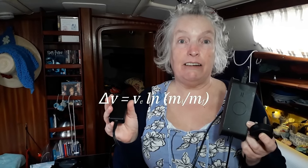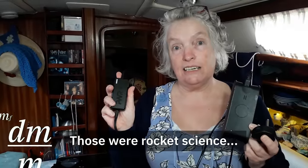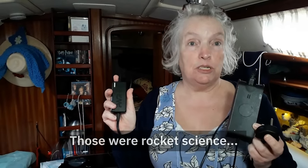When you're out cruising, one of the things you really need to think about is efficiency. It's a lot more efficient to use a DC-to-DC converter. This is our DC-to-DC converter for our laptop — just look at the size of it compared to the AC-to-DC converter. Going from DC to AC and then AC back down to DC is very inefficient. With a DC-to-DC converter you're only doing one conversion — much more efficient.